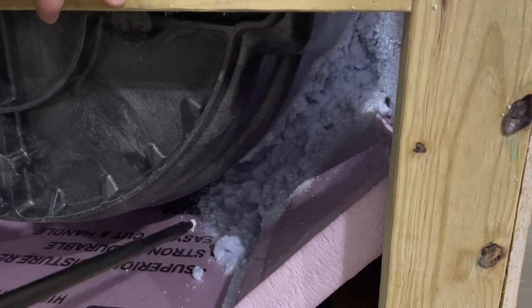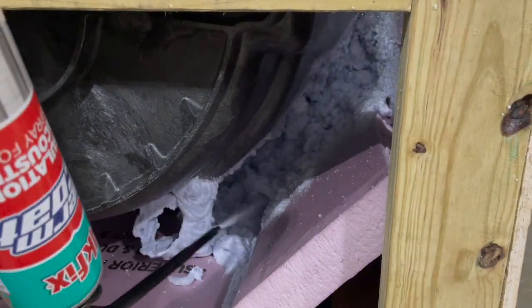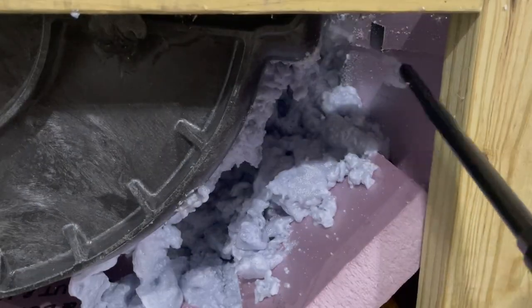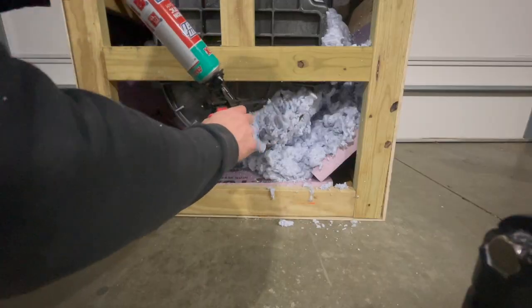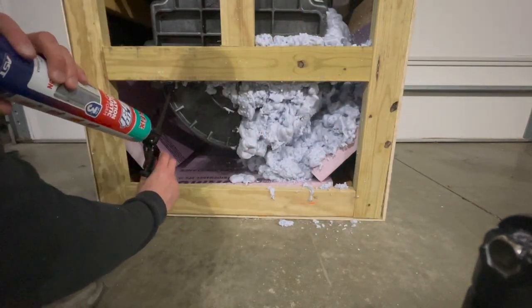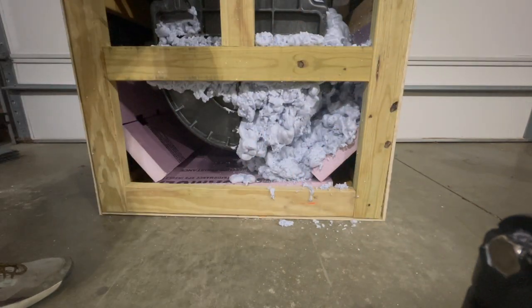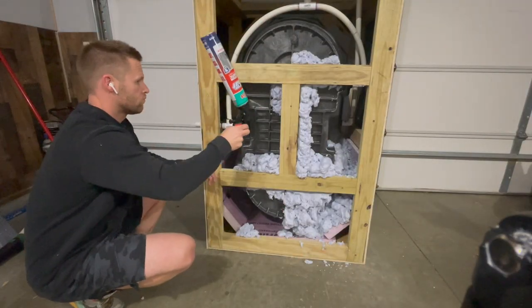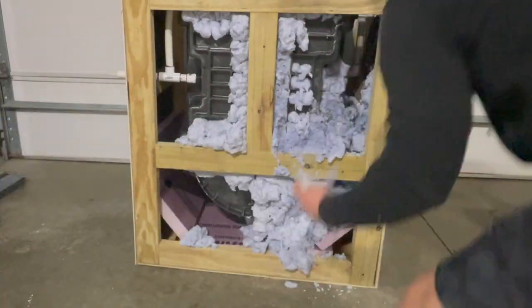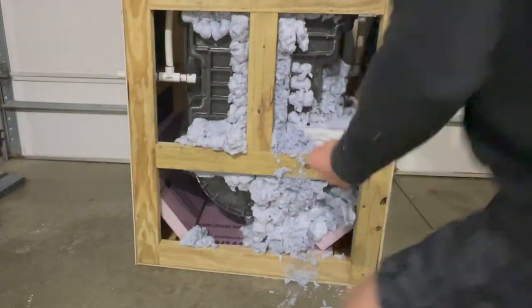You can see here that I tipped my cold plunge up on its side and started spraying as close to the top as I could. From there I started spraying the little pockets behind the 2x4 supports, which is a really good idea except that the spray foam will drip down to the floor. So tip number two is to tip this thing down on its back.